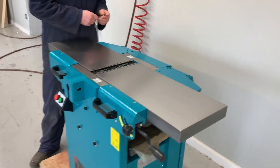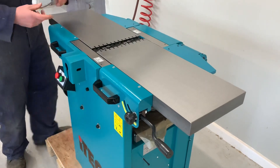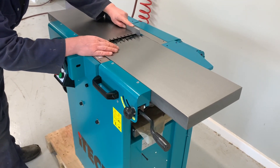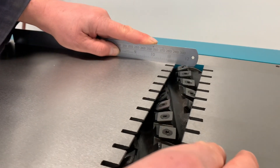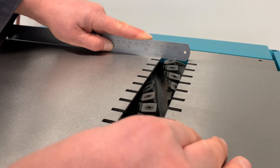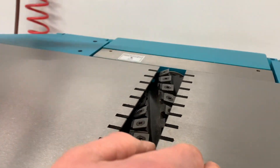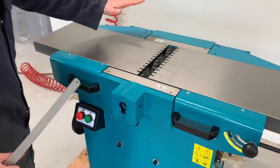Set the table parallel. The first thing we're going to do — this is going to be our datum corner. Get a straight edge or a rule, put it flat on a table and you want it just to scrape and pull the straight edge across. We know this one's right, so this is our datum — we know that's set.